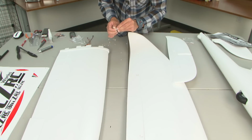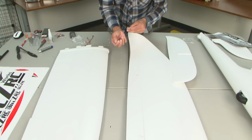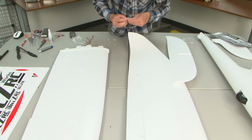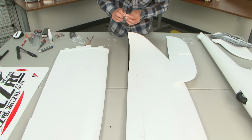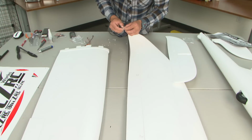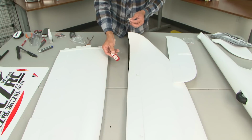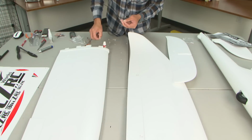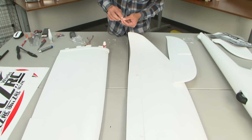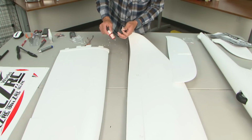Okay, at this point here, you have a little itty bitty nut. That nut will go on there, and you're going to be tightening this with a pair of pliers or something like that, and then feeling this right here. And see how that feels, okay? And here's another pointer. At this time here, if you have Loctite, I will put just a tiny drop of Loctite. You can't put too much because if you get it inside the area where it needs to rotate, it'd be really stiff there. So we don't want to do that, okay?